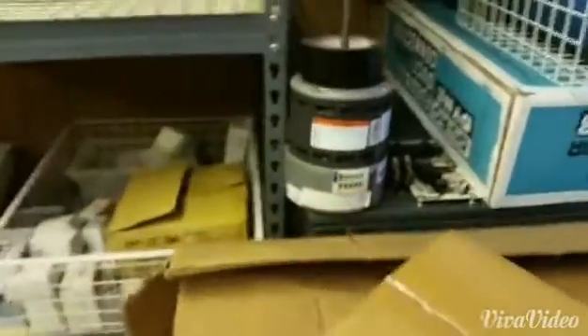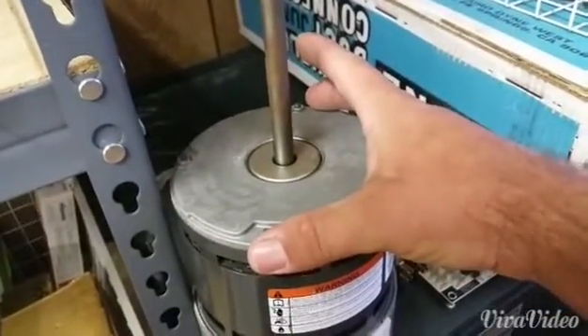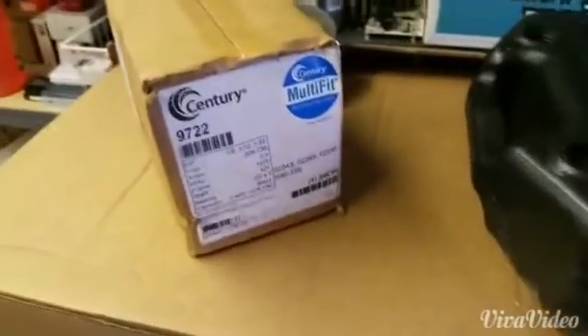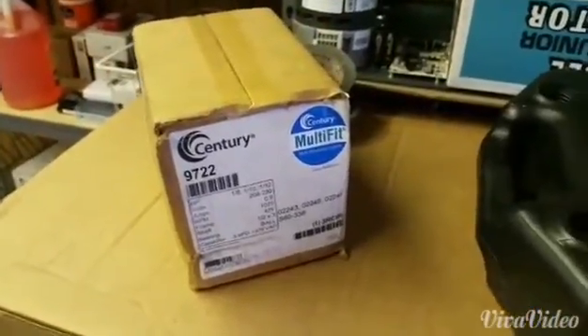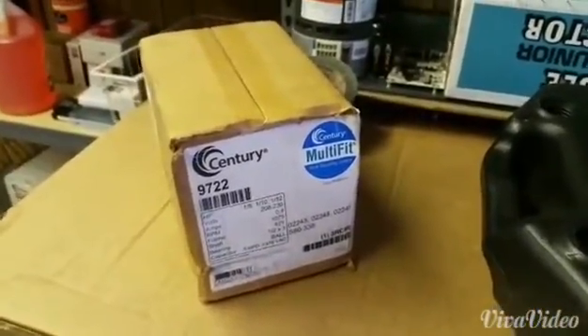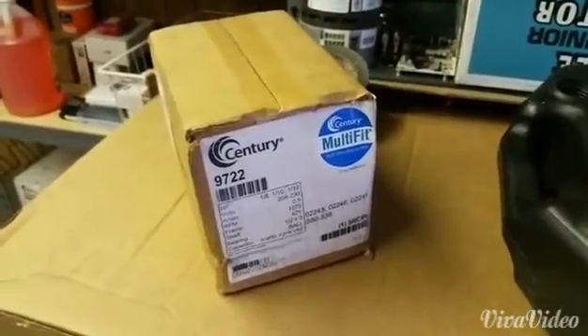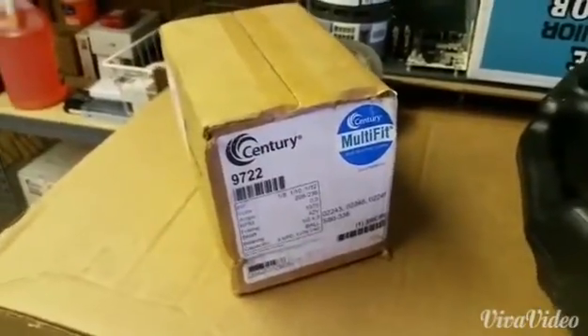You can see my little ECM motor over here, which is an evaporator motor with a certain diameter — 42-frame is just a little bit smaller. Around here I'm used to seeing them on Trane, Goodman, and Nordyne, but I'm sure there's more that they fit onto. It's always an odd little size, so it's kind of cool to have one in stock so if you run across one by chance you don't have to worry about trying to locate that odd-sized motor.